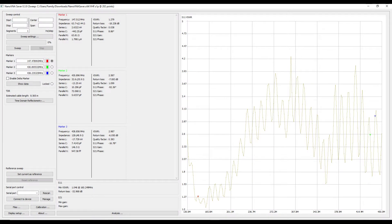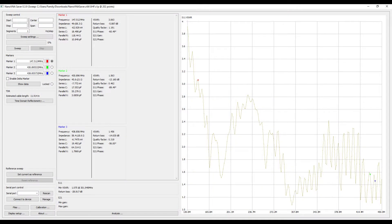Here's the trace for my VHF antenna. It's a stainless steel folded dipole, so it doesn't do quite so well on UHF even though it's slightly tuned towards it. But the SWR down in the VHF ham band, 144 to 148, is quite good. Not a bad antenna — I like it a lot.